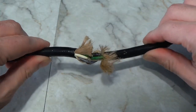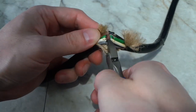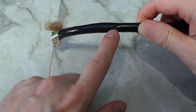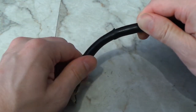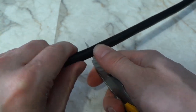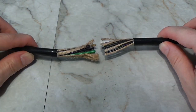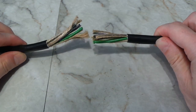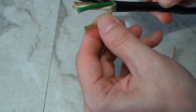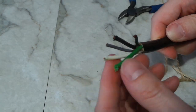Here's the mess we're dealing with. The first thing to do was to clean this up, so I went ahead and cut this thing apart. I could see some additional damage a few inches down, so I trimmed off that whole section. The next step was to strip the insulation off — I did a few inches on each side. I wasn't sure what to do with the little ropes inside; they're there for tensile strength, but I eventually just decided to cut them off. At this point there were just five wires to deal with.